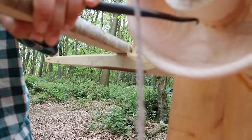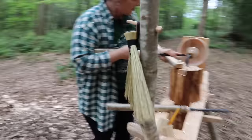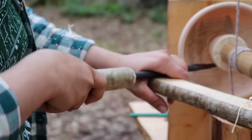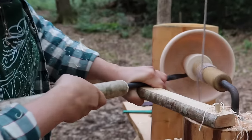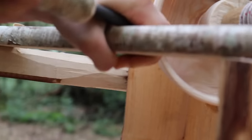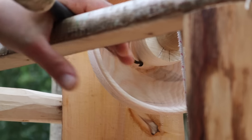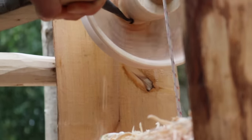So it's here, and then I'm gonna slightly turn it in so that the cutting edge engages. And you've gone this far in the bowl, even if it's your first one, even if it's your 20th one, you've been using the hook in the same way at other points. So I'm gonna create that shoulder. And I'm gonna just keep working that shoulder down. I don't wanna put too much pressure down on this end and up into this because then it really starts to bounce and it gets harder to get an effective cut. But I need to do so a little bit so that it keeps tapering.